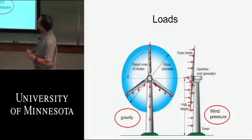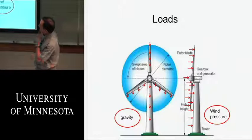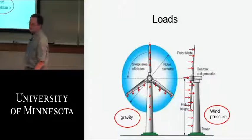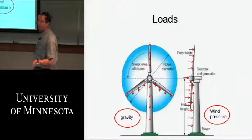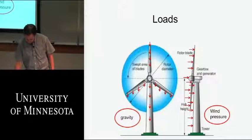Professor Mantel was talking about loads. I kind of illustrate this on a small-scale turbine model. So we have gravity loads, and those are always vertical, but relative to the rotating blade, they are changing their position. So essentially, they cause time-dependent loading. And one of the most dominant, most important parts of the load is the wind load. This is why the turbine rotates, and it also causes significant forces within the turbine. So the goal of analysis is to compute the deformations and the forces within the turbine. These forces are really what cause a failure of different sorts, fracture or rupture of some sort.